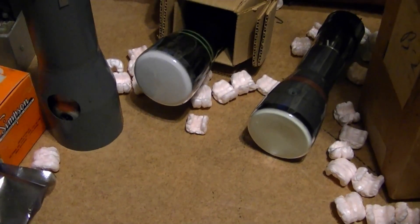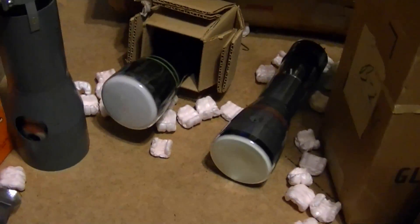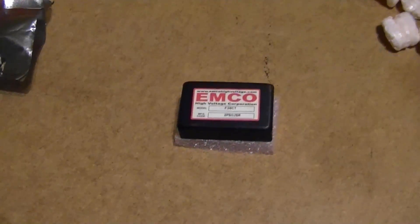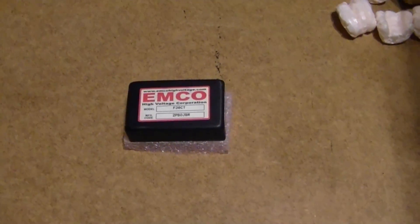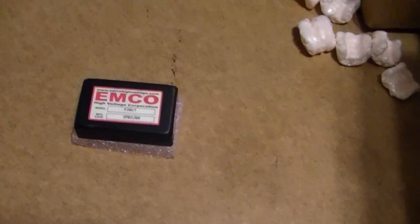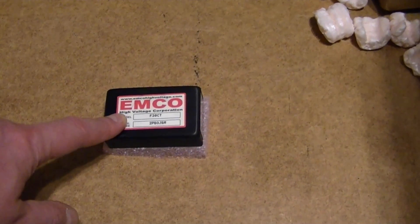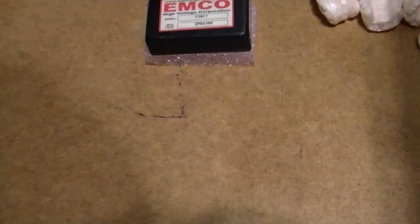I could derive everything else externally. And what do you know — there's a guy selling a bunch of pulled solid-state high voltage supplies, variable high voltage supplies. These are pulled off of boards — I don't know, from photocopiers maybe, something like that where they needed a few thousand volts. These were not the defective part, something else was. You put about 0 to 15 volts DC in and you get 0 to 3,000 volts out. I have tested this and it works fine. So I'm going to put up a little power supply with that.